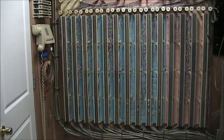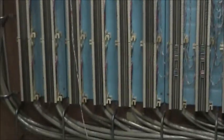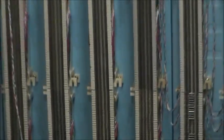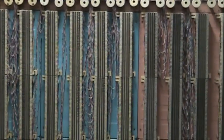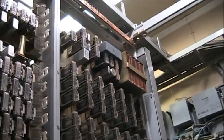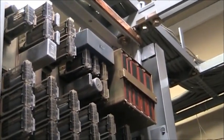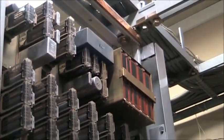The first six rows of 66 blocks are connected to call directors. Each row has two telephone cables on it, each one a 100-pair cable, with a 30-button call director connected to the other end. I do not have all of this connected yet. At the top of the bay I have a 247 intercom connected with a 207 selector and a transfer relay to extend it to 19 lines.